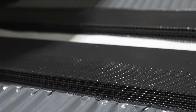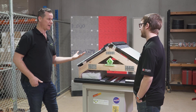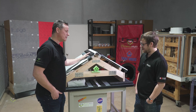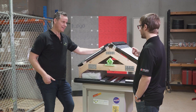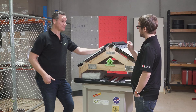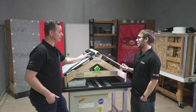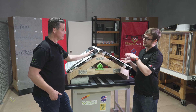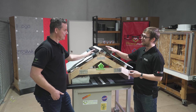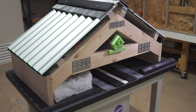Some alternative solutions for BAL ratings that I've heard of is using gutter guard. I can understand the thinking, but the issue is the openings in gutter guards are just too wide to actually comply with the requirements. Even if you use a gutter guard, you would have to line the inside of it with a mesh — which is exactly what we've done with our vent products.